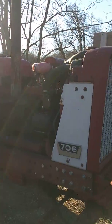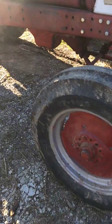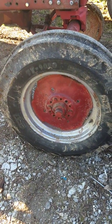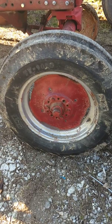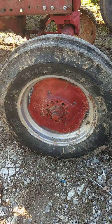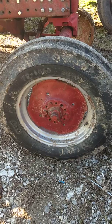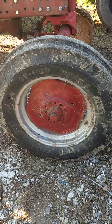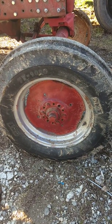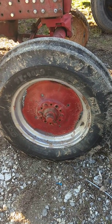I've got a hood for it as well. That's something else that needs to be done. It's not a priority in the fact of, well, the tractor works without a hood. But yeah, I'll maybe take a couple pictures and insert those in front of the next video of the disassembly and what have you. But basically, I'll just post another video after the change from 6 to 8. And another thing that led me to know that it was possible was the fact that an 806, if it was gas, would have come with 6 lugs, and if it was diesel, it would have come with 8-lug hubs. Diesel engine's obviously much heavier.